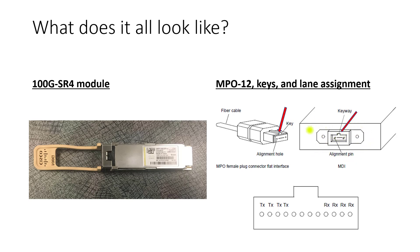As you will see, especially in the IEEE document, they generally state that the de facto method should be to use female MPO connectors and the QSFP should be male. That holds true for the Cisco 100G SR4 module — you will always need an MPO12 female connection.